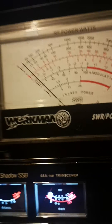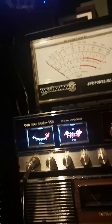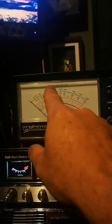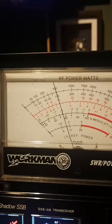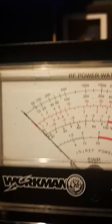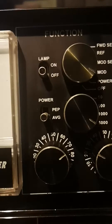All right, so about 15 watts. We'll flick the meter to the 5000 setting — there'll be the line up the top. We'll turn on the meter, turn on the amplifier, and fire on. We just slammed in over the 500 mark — right on 500. That's on average power — PEP is pretty much the same.